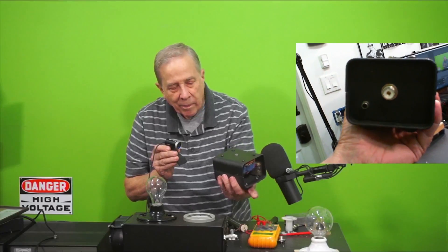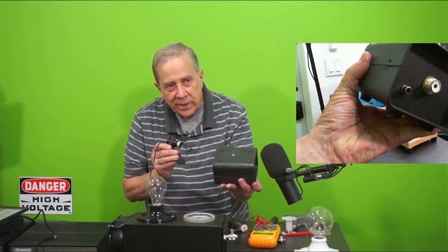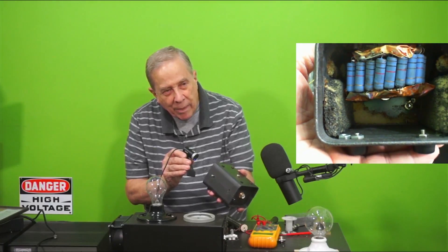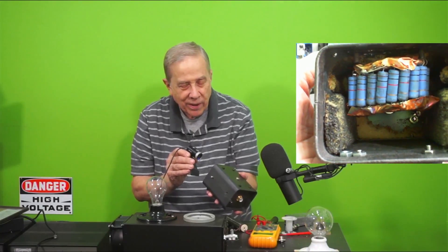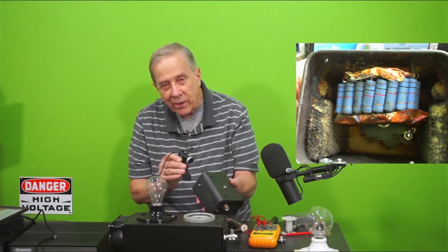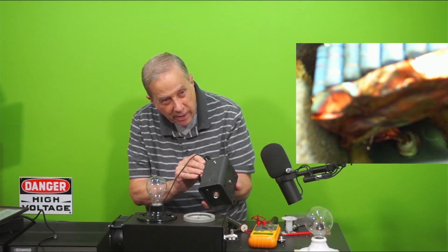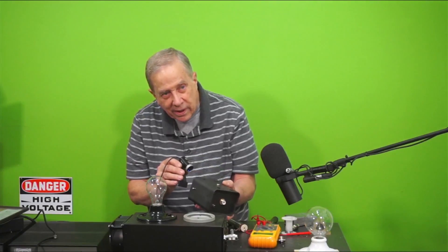It's a box that had a relay in it, sold commercially for ham radio operators — I've acquired a couple over the years at garage sales. The resistors are on the inside kind of in a circle and I slapped copper on the top and bottom. Now that is just horrific looking, honestly. The solder connections are good — they're not cold, but they're ugly, and no matter how hard I tried I couldn't make it look any better. I'm hoping that with the copper plate it will remove any inductance, because I've slapped that copper over the top of it.